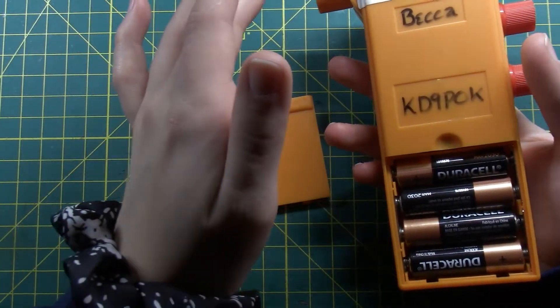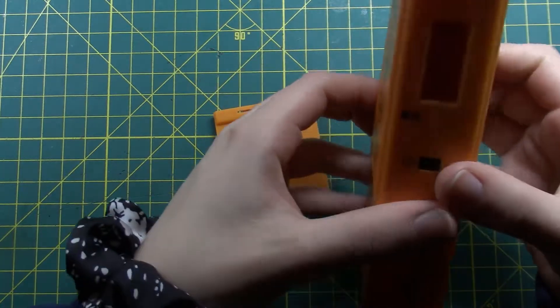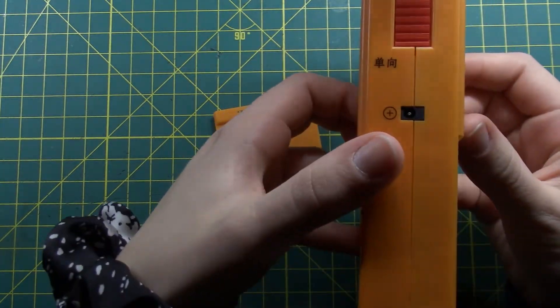What you can do is bring your transmitter and your receiver next to each other, turn on the transmitter, and then tune this until you can hear the transmitter. Then go hide it — make sure you don't bump this — so that you're actually listening to the right thing, and you'll find the transmitter. This back here is just a battery compartment; takes four AA batteries. And I don't know what that does.